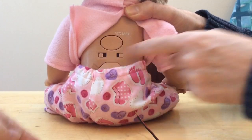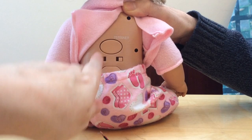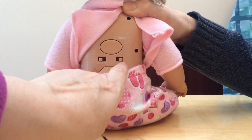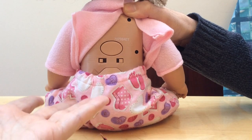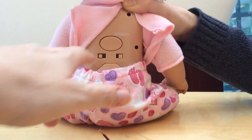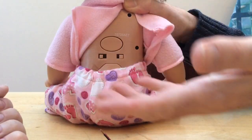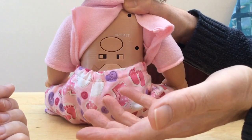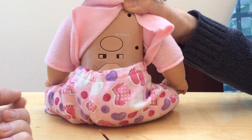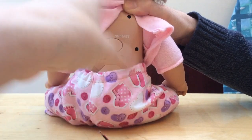So this isn't a permanent state — it's momentary. We call them buttons but it's just another form of switch, doing the same thing: joining two pieces of wire together to complete the circuit. When this goes from low volume to high volume, or from English to French, that is sending a signal pulse which the microcontroller understands. When you press the button, the level goes from zero to one — just to put arbitrary numbers on it — and the microcontroller detects that and takes some action. You let go and it's back to zero.